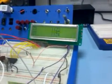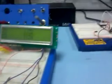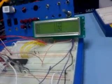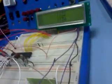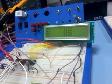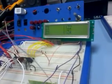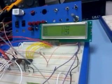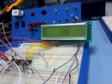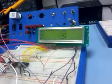Final test, low battery. These sensors can be really in a box unit, battery operated. Battery life is now prolonged because the transmitter is not transmitting the whole time. Therefore, I've saved something like 7.98 milliamps or something to prolong the battery. Therefore, the only thing that is draining power all the time would probably be the sensor, because the encoder is mainly in sleep until a sensor is activated. So, if these units are separate and battery powered, and placed in a system, we need to know when the battery or when the sensor is going to go down.